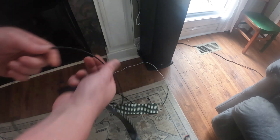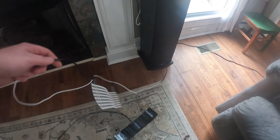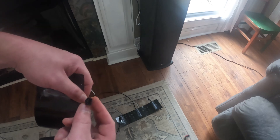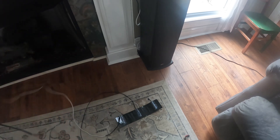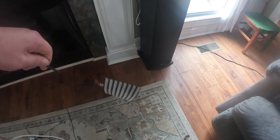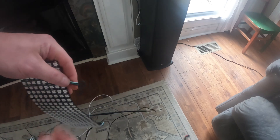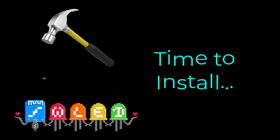I did a sloppy job of hot glue on the back of these just to keep the wires from pulling off the pads. Then I also made an extension for this, which is just extra power. I also made another long cable — it's just 22 gauge wire. For those of you that don't know, the female connector is where power comes in from the WLED board, so this extension cable will be what powers and sends the LED instructions to the next strip, and so on. If I decide to use two more in the future, I can just plug the female end in here and the male one into the next strip. Let's go ahead and wire it up and get everything connected behind the TV.